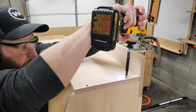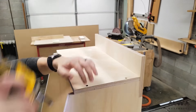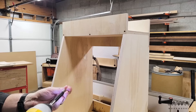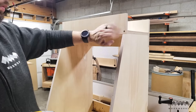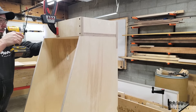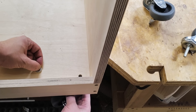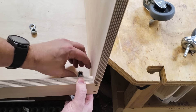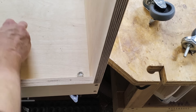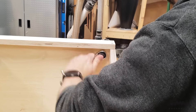Now it's onto the top of the cart where the cyclone will sit. I butted the bottom panel up against the upper back stretcher and secured it with four screws. I then added a front panel by securing it with three screws, and finally the two side panels by securing them from the front and back with two screws each. Next I added the casters by inserting them into the four holes I drilled in the bottom and securing with lock washers and lock nuts. Turning the cart on its side allowed me to securely fasten each caster using a wrench and pliers.